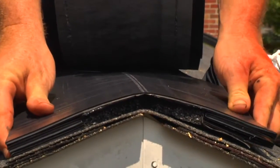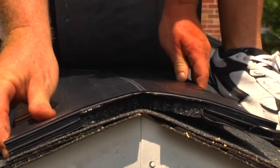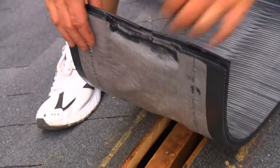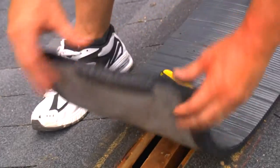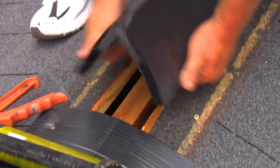Install end caps at the beginning and at the end of each Quarrix Ridge Vent Rigid Roll R Series and Ridge Vent S Series vent section. If the roll or section is cut in any place, a foam end cap should be installed for a weather-tight seal.